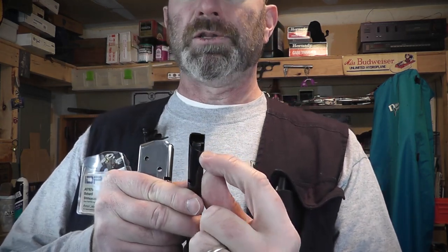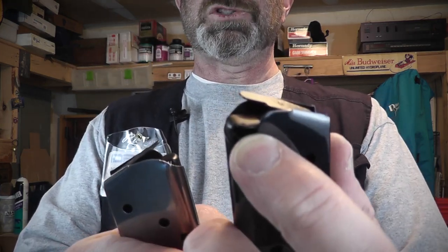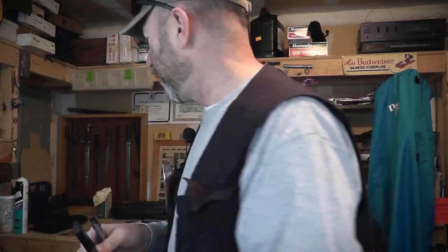There's also a slightly improved follower. This is the patented bullnose follower — essentially a product-improved version of the old Devel McCormick shooting star follower, in that it has a skirt that wraps around the front and keeps the follower from tilting. One of the knocks against the old shooting star follower is that because it's only in contact with the back of the tube, it can tip forward. The skirt at the front prevents that tipping. They've also slightly widened the shelf that engages the slide stop, so you've got a little more purchase to help ensure reliable lock back.